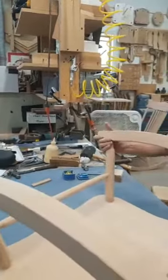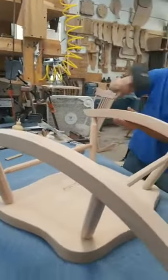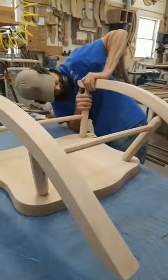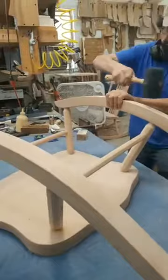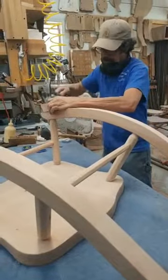Rocking chairs have a function of not tipping over. A lot has to do with the angles, but also the longer rocker end. There's a flat section toward the end too that helps to level out when you're rocking, so we can recline back without a fear of tipping over.